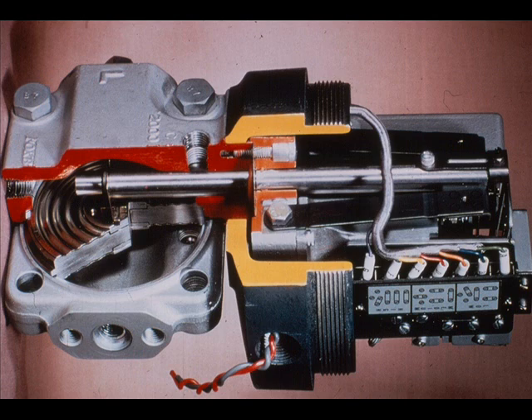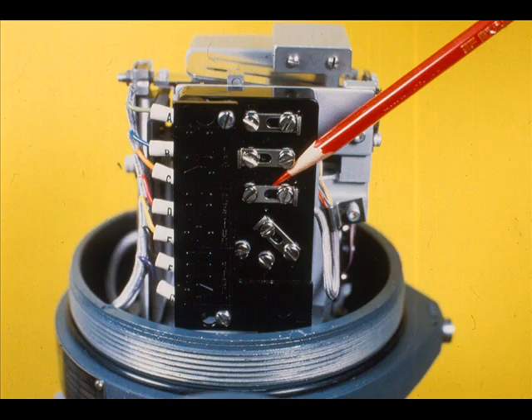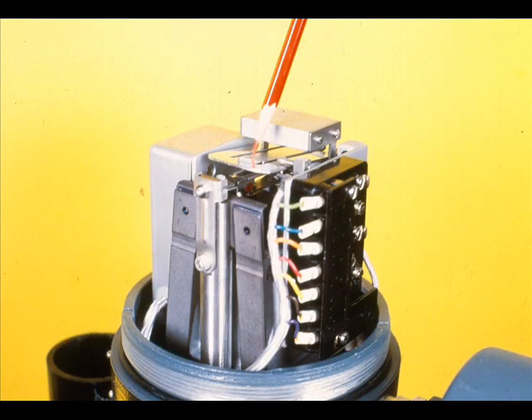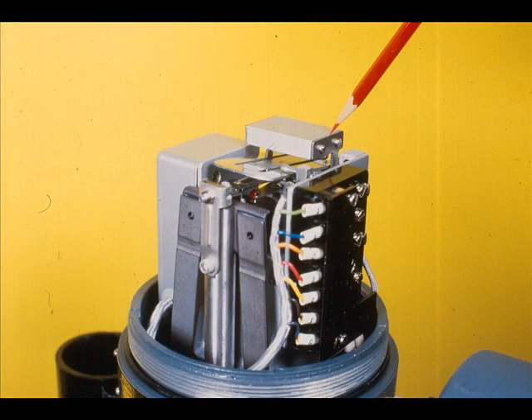The seal diaphragm can be seen in this cutaway view. The red and gray wires are the positive and negative DC wires. These are the span links and span selector terminals; the span of the transmitter determines the arrangement of these links. In the following views we shall identify the span adjustment screw, the vector assembly, and the counterweight, which counterbalances the weight of the voice coil in the lever system.